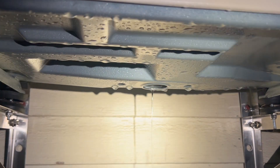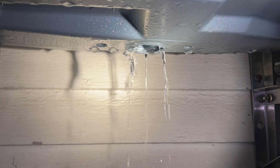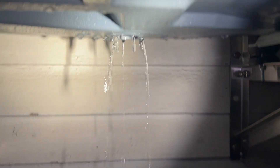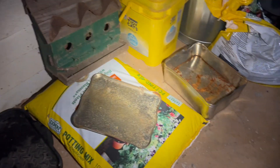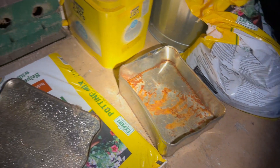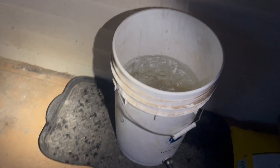The drain line is frozen solid so it's not draining. There she goes — she's defrosting. I never realized how much condensate a mini split makes when it's in heating mode; it's absolutely crazy. That doesn't even happen inside with the air conditioner — the coil doesn't freeze up when you're in AC mode. At one point I was using a small container to catch the water and thought that would be enough. Nope. I've got a six-gallon bucket here and she's almost full, splashing everywhere.